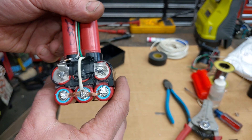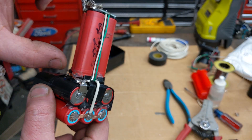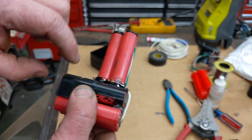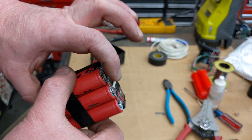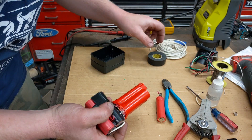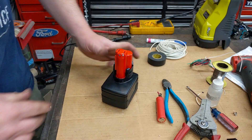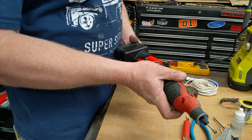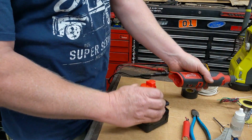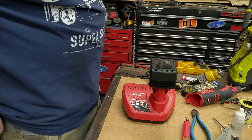All done — it's not super pretty but it's functional and works, and it's on the inside so you'll never see it. The green and white balance leads monitor the voltage between each cell group to charge the pack properly. Voltage tests out perfect — let's put the collar on, put the base on, it all fits together. Let's test it out. That works — put it on a charger, it might be too full right now to charge. This is fully charged.